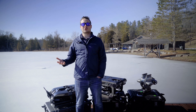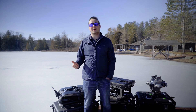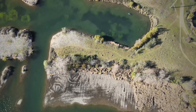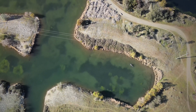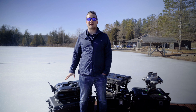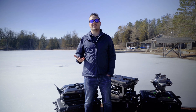I was recently part of a boat search in Fresno, California. Before I arrived with the ROVs, the team had done side-scan sonar scans of the lake bed and identified where they believed the boat to be. Interestingly, the week before, another ROV system from a neighboring organization had been unable to verify the side-scan sonar target. A lot of that came down to the topography — there were big mountains and valleys at the bottom of the lake, and the boat had fallen into one of those valleys. Because our ROVs have an actuated sonar system, we were able to angle the sonar further down than most other systems could and very quickly scan the valley where they believed the boat to be.